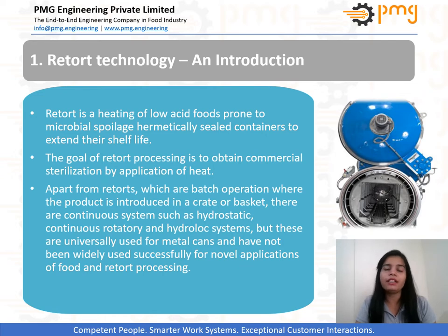So the retort is designed as a pressure vessel. The material of packaging must be inert, heat sealable, dimensionally stable, and heat resistant — usually 115 degrees Celsius to 125 degrees Celsius. They should have low oxygen and water vapor permeability and be physically strong to resist penetration by the food stuff contained and abuse during handling and storage.